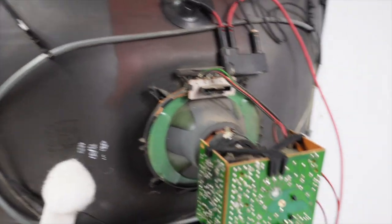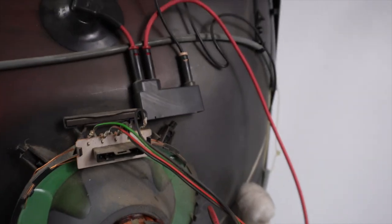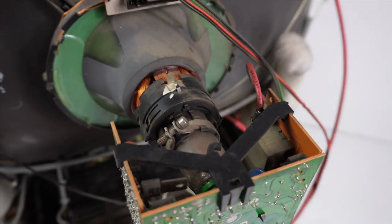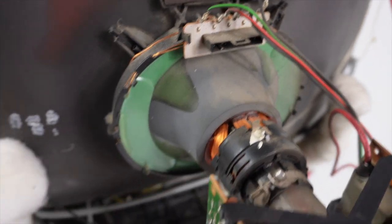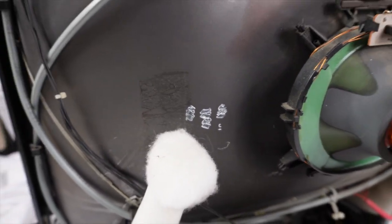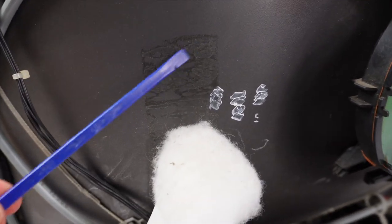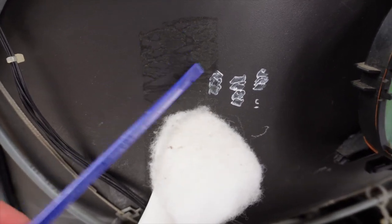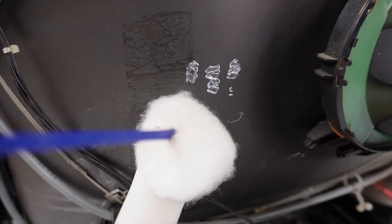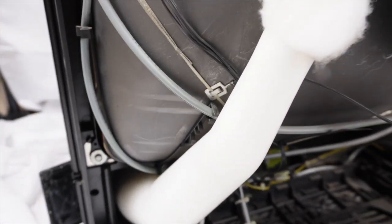Inside, I'm admiring the neckboard that's been divided into three sections to keep it very narrow for the case. Bonded yoke, which suggests it's probably a Philips tube. Often the label is absent or missing — I think more missing in this case. There's quite a bit of residue there where the Philips sticker probably was. And look at this foamy, woolly mass here in this tube. Big audio socket.